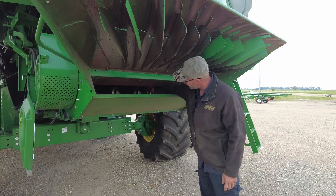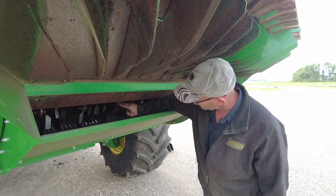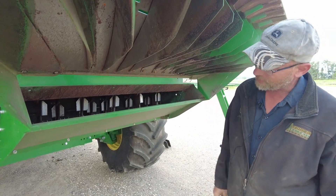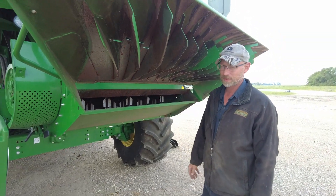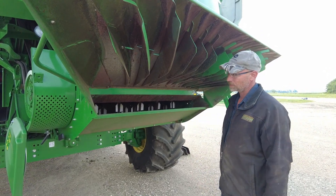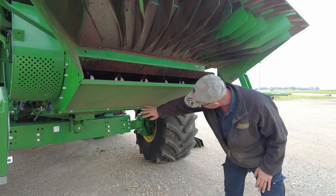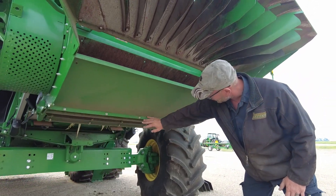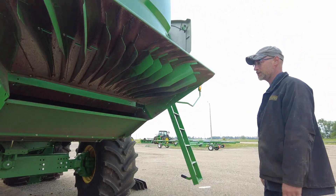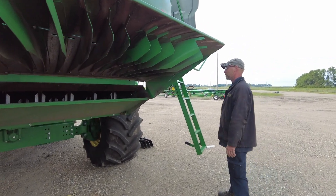Come inside of our chopper and take a good look at your hammers. Spin it over so you can make sure you don't have any chips, chunks, or anything missing that's going to cause the chopper to vibrate. Also look at your condition of your stationary knives — they can either be flipped over or would need replacement. Another common item on the back that wears is the bottom of the chopper housing; they wear holes right in the bottom edge down here. We want to make sure that's in good shape so we don't catch material or have anything hang up with big holes in it.